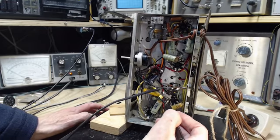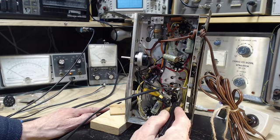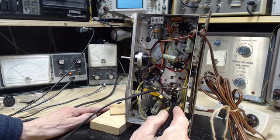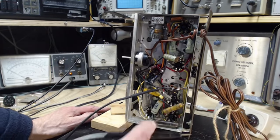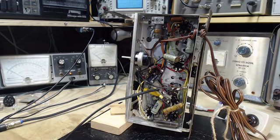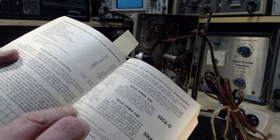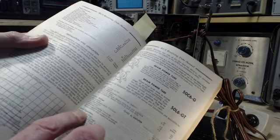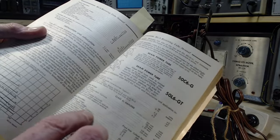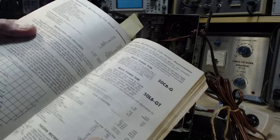1, 2, 3, 4. This is 5 here. So we see there's a negative voltage. You can see my meter going up a little bit. Same thing I measured before. Half a volt. What does the book say it should be? The book will give us a hint as to what it should be. Heater current, 150 milliamps heater current. Maximum ratings. Typical operation. Grid number 1, control grid voltage, -7. Cathode bias. Well, they didn't put the resistor in there, did they?